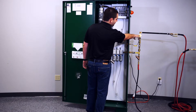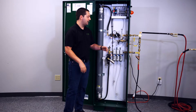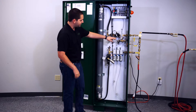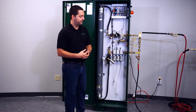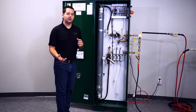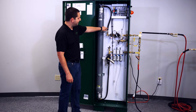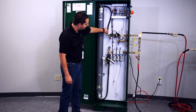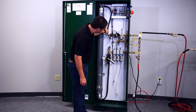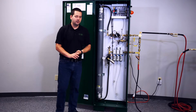After you have that ball valve open, close your outlet valve. Once your outlet valve is closed, all the nitrogen goes out the flow meter. For this particular model, we're looking for about 425 standard cubic feet of nitrogen production. As you can see, we are quite a bit low. This knob is what we call a flow control valve or needle valve — it increases the nitrogen flow, and conversely, an increase in flow will lower nitrogen purity. We're looking for 425 cubic feet, so I'm going to increase that by loosening this knob. That's about the flow that we want to be at.